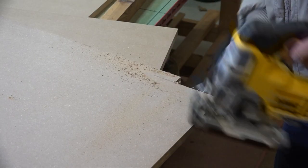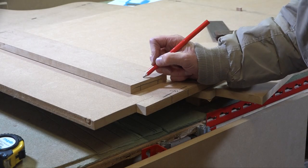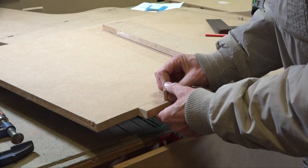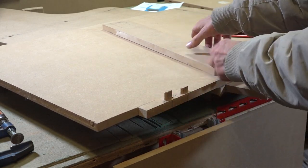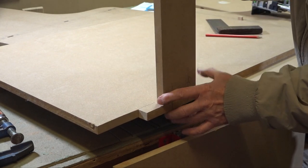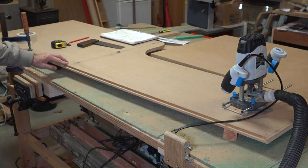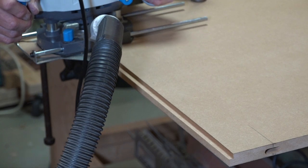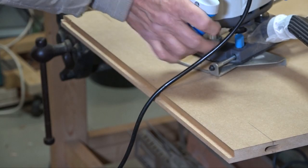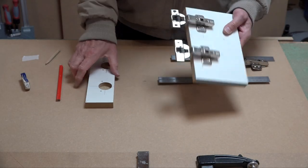The rear back corners of the cupboard are going to need a little cutout to accommodate the skirting board. I put a brace across the back of the cupboard. It's only about 100mm high. This is one end of the piece. Again, I've used dominoes to each end. I'm going to put a white hardboard panel into the back of the wardrobe area. With my router, I'm making a rebate for it in the back edges of both the sides, the shelf, and the top. I'm going to hang the door with a pair of kitchen cupboard door hinges.